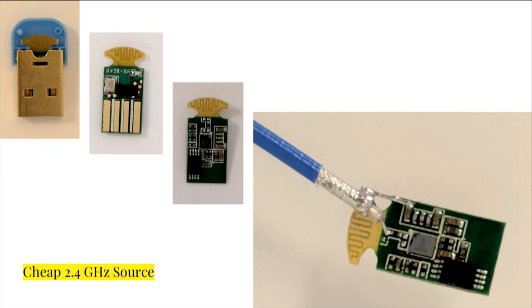This took 3 attempts? A couple of tries, yeah. I think I did a really good soldering job on this one. You can see in the lower right-hand corner, you can't see it behind the cable, but I've nicely cut the original antenna trace, and then I've soldered the wire onto it. And then afterwards, it didn't work. And we're like, why doesn't it work? If you look closely where the mouse is right now, you can see Mike melted the corner of it. Yeah, somehow I just destroyed it. A chunk of it is missing.